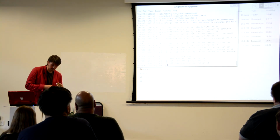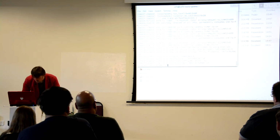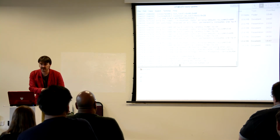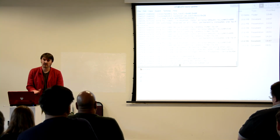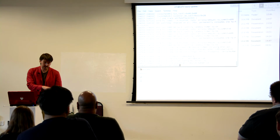And then it's pulsing as if it was a USB device, certain wires. The diodes are in there to cope with the fact that this is running at 5 volts, which is, again, a convenience because plugging stuff into USB, running it off of certain batteries is more straightforward. We could switch it round so that it ran at 3 volts or something, but it just makes things more complicated. So we've got Zener diodes that have stepped down from 5 to 3.3 volts.